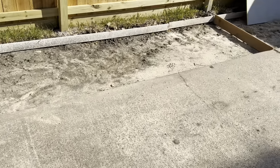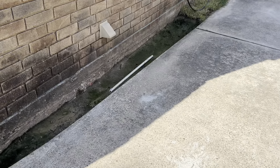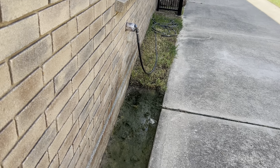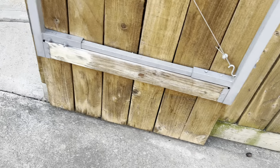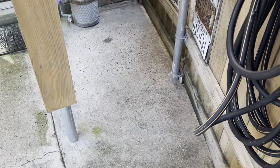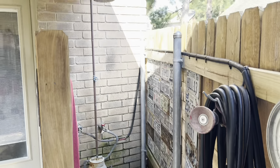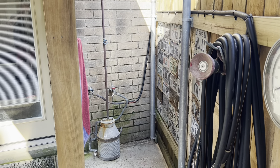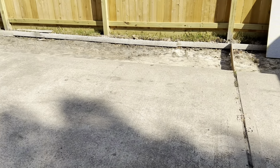We're going to do this side as well, because there's no point in having that little strip there. We've had pretty good luck with it. I've done this already a long, long time ago — this was all grass and dirt and mud, and then I concreted that and we put in this little outdoor shower. I'll put a link in the description below for that video. So we're going to get this one formed up, start pouring it, and see how it goes. Almost got it all formed up, just putting a few little rebar chairs down. Our goal was to leave the post out of the pour — that way when the fence gets replaced, we won't have to bust into the driveway.